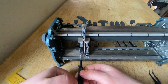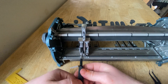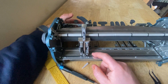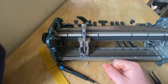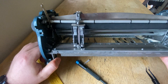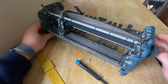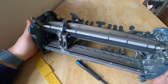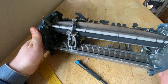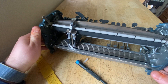So the way to describe it is: six legs on these skates slide along the rails, and when you press a key it rotates the rail and pushes upward on the skate, which creates the dot. There's also something wrong with the paper feeding mechanism — I can see that some things aren't in alignment, but I'm not sure why. Anyway, thanks for watching, bye.